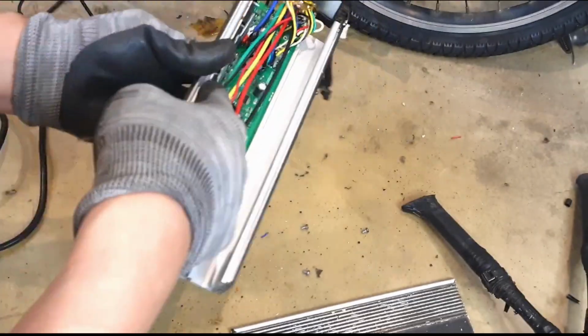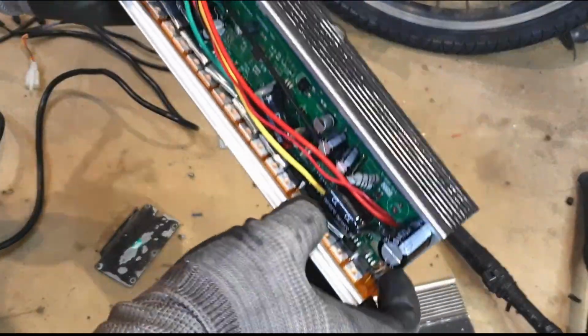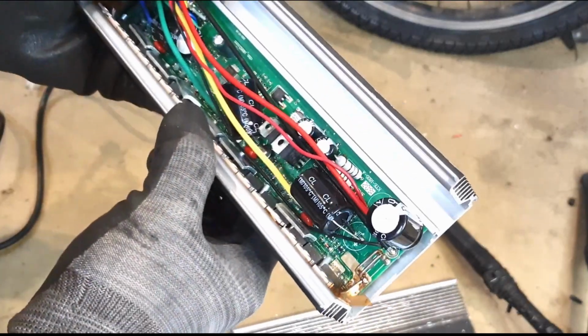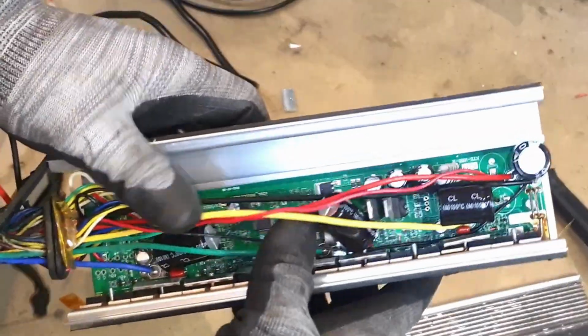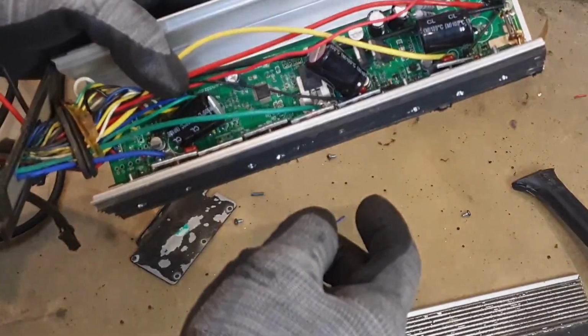This controller is easy to disassemble. You only need to open the top cover without touching the side cover bolts. Upon opening the cover, you'll notice several MOSFETs arranged inside. A faulty 5 volts output is critical as it's also used for the motor hall sensor power. This product allows easy disassembly by just opening the top lid without removing the bolts securing the MOSFETs.